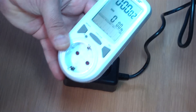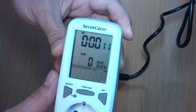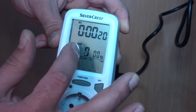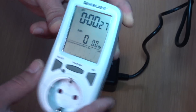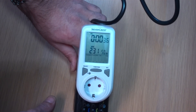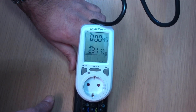So let's now reset it. The display is quite nice. But some things like here — it is showing that it is in the volt mode now. It is pretty small and maybe it is me getting old, I can't read that from a distance. It shows your wattage and current rail. Let's put it in our socket and see what it shows. It takes a while before it gets the first measurement. The update speed is not that fast. It is showing that I have 232 volts and 50 hertz.